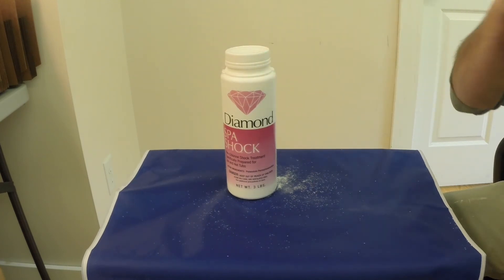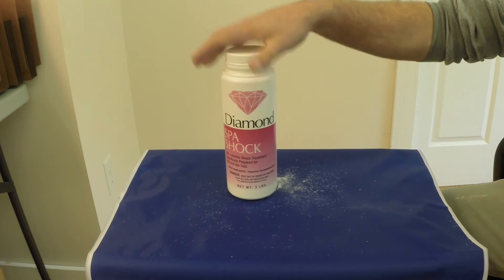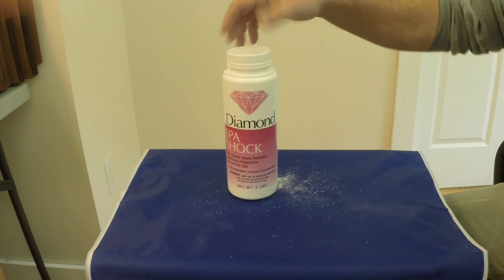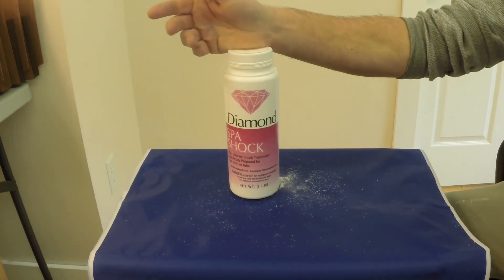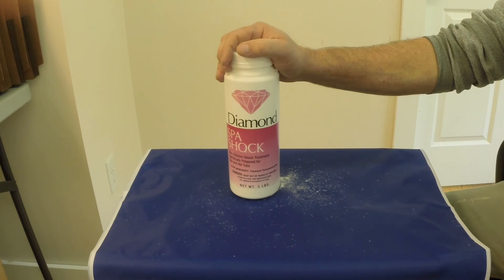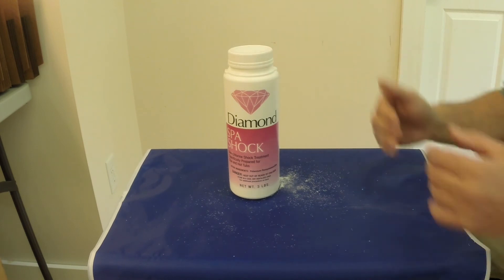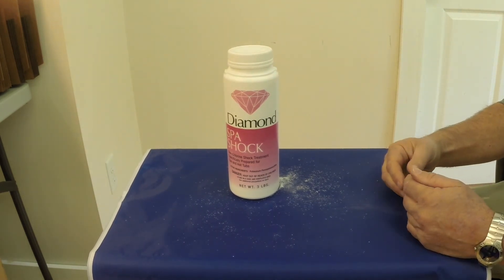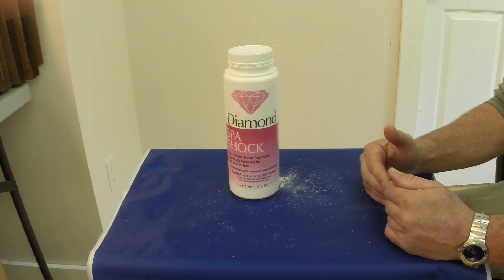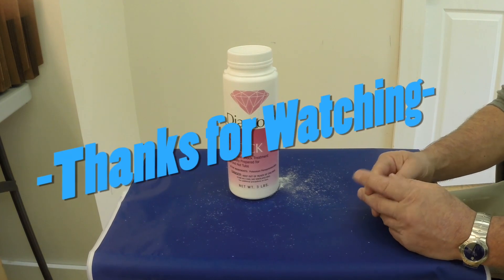However, you're not dealing with as strong a sanitization product here. Of the three, this would be the lowest on the sanitization scale. So again, monopersulfate — easy on the sense of smell, effective in dealing with chlorine lock in the spa by making the free and total chlorine equal. However, on a sanitization scale, it is much lower than the granular bromine or the stabilized dichloro chlorine.